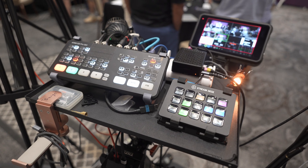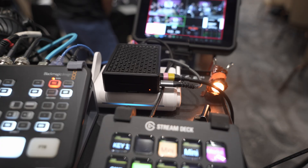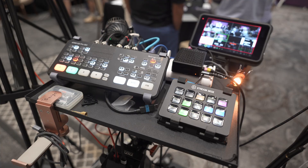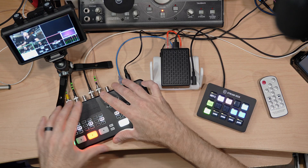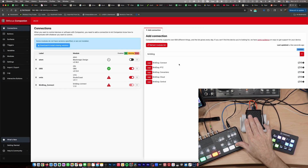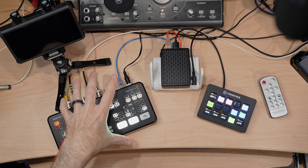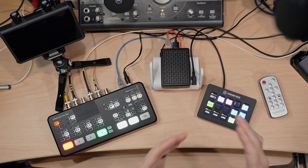Here's a quick shot of this setup during my last show where I needed to have a very compact footprint. I had an ATEM SDI Pro ISO on a tripod stand, along with my Stream Deck, my Raspberry Pi, and a small travel router. In this case, I needed to control some functions of the ATEM that you could not do on the ATEM itself, and I didn't have space for another laptop to run the ATEM software. So I pre-programmed Companion to activate macros that I had built prior to the show and saved in the ATEM, and I also programmed the preview buttons and the auto transition button on the Stream Deck. You can scale this up to any hardware you want — just add your devices to Companion on the Raspberry Pi. This tiny setup still allows me to configure everything ahead of time and have it run whether or not my laptop is connected to the network.